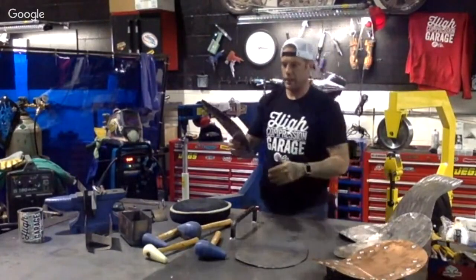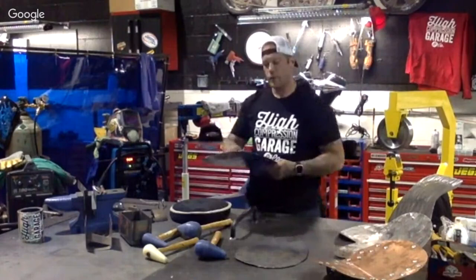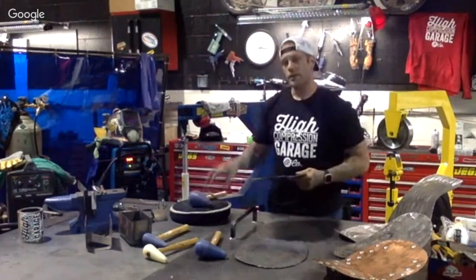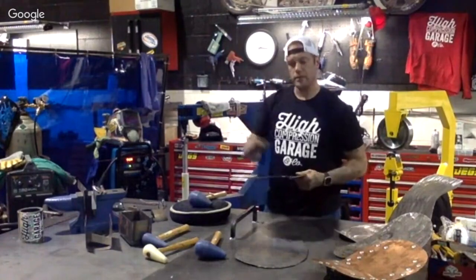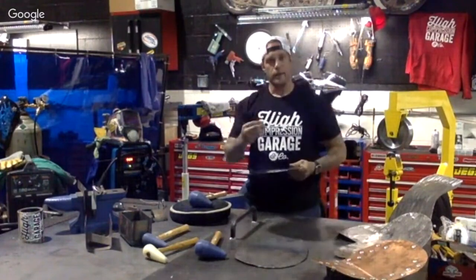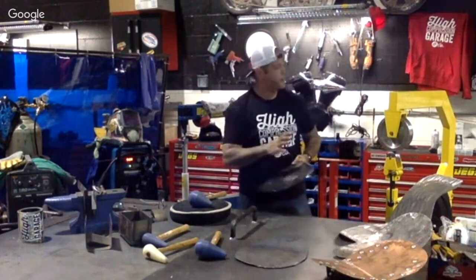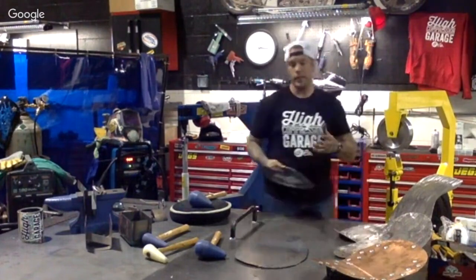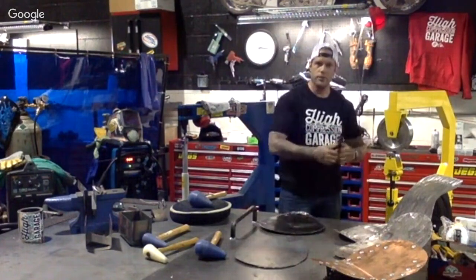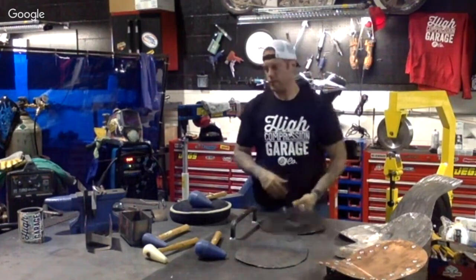So kind of to recap, if you're doing a seat pan, if you're doing a battery box or a dome, the main tools that you're going to use are your teardrop mallets. Those again are to put a lot of scoring marks in it to start giving you that radius. Then you're going to move on to the shrinker and stretcher, start shrinking down all those waves on the end and get that metal more consolidated to work with. And pretty much what we can say is that this is your finalizing tool. Outside of grinding and getting prepped for paint or powder coat, it's going to be the English wheel, getting all those bumps out and giving you a nice looking pretty end cap to it.